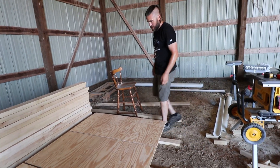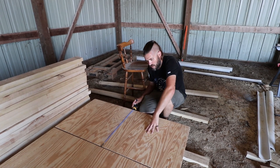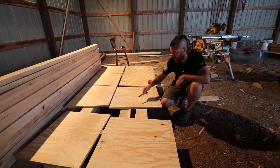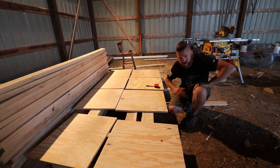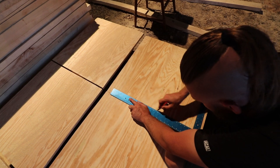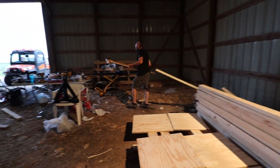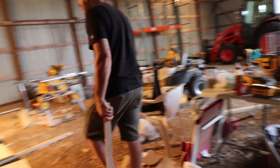You'll see how when this goes together, how we're going to get a 21 by 24 by 26 inch form out of this. We're not matching these up corner to corner — we're going to match two of these up so that the inside dimensions are 21 inches. So this is not 21 inches wide, it's 23 and three-quarter inches wide. I've made the appropriate marks and now I just need to draw a straight line. First thing I'm going to do is cut 26 inch chunks out of this. One short piece isn't going to matter too much. We'll go ahead and use it as is.